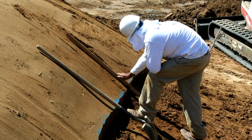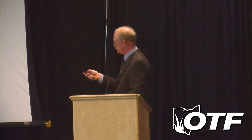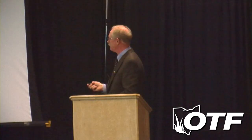And this slope right here, under this shovel handle, will get straightened out. That's not flat enough. That's the natural angle of repose bunker slope that Pete Dye brought back, and it's very difficult to get in the field. It doesn't matter how experienced the contractor is, we have to sit on them all the time. That saves money, because if these slopes get steep at the bottom on that rounded face, this stuff is hard to mow. You're reaching further down, and the angle of the fly mower, whatever you're using, gets steeper and steeper. It can even get dangerous. So this actually saves money by putting some money up front, making sure the contractor understands this kind of shaping is absolutely what will be demanded.